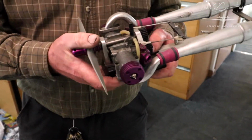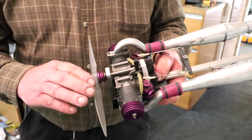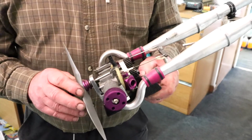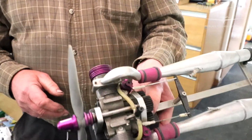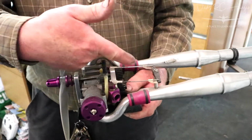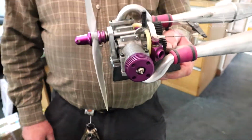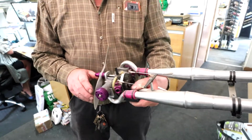So this is two West 36 V1s, which do about 23,000 on the ground. So I geared two of them together. The reason they're facing that way is because with the gear, you can now run the prop in the normal way. Wow, that is serious engine.